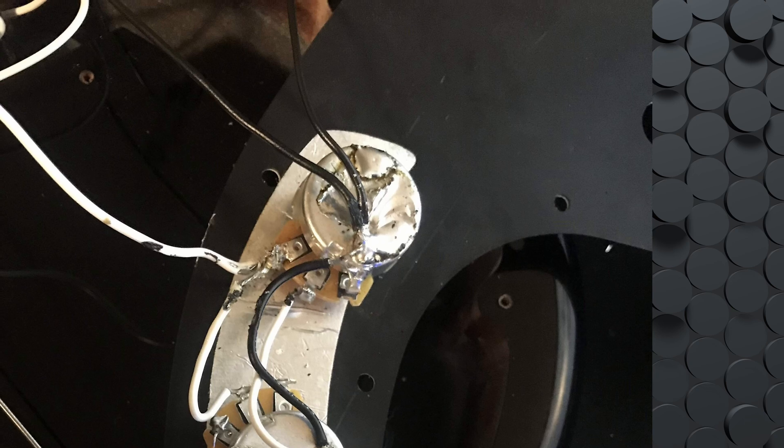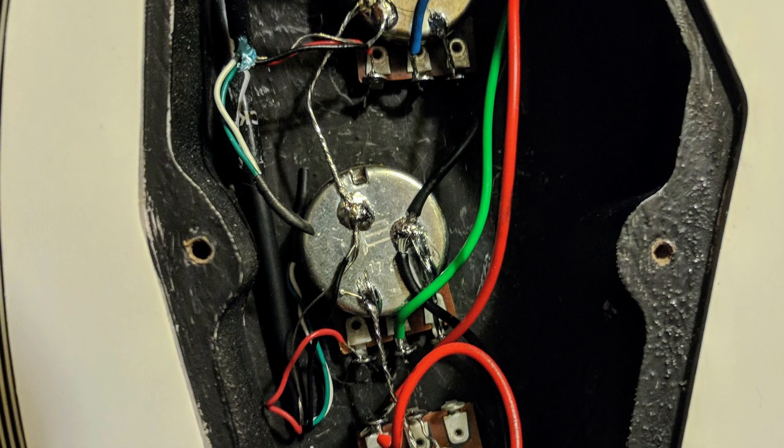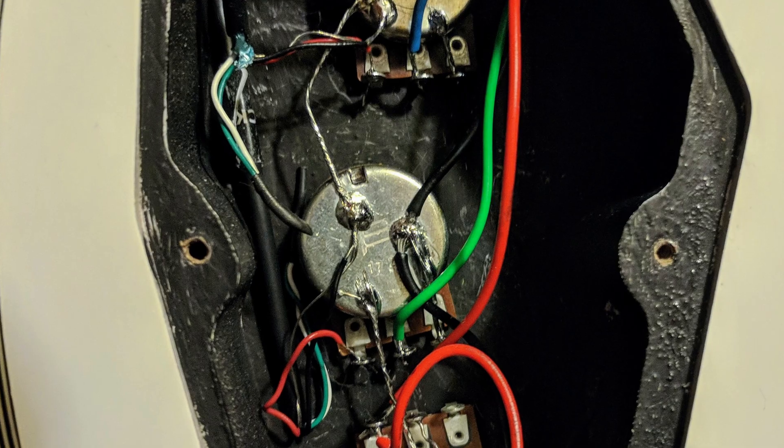If you're doing completely new wiring with a new volume pot, you have to scratch the back of it for the solder to even connect. Then you have to make multiple big globs of solder because it's going to be really hard to get five, six, seven wires all onto one glob of solder.